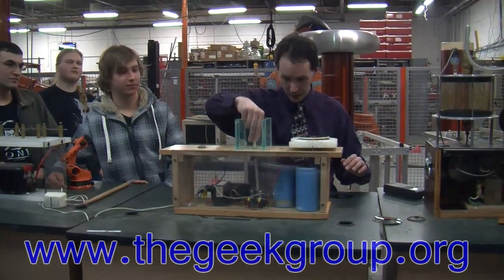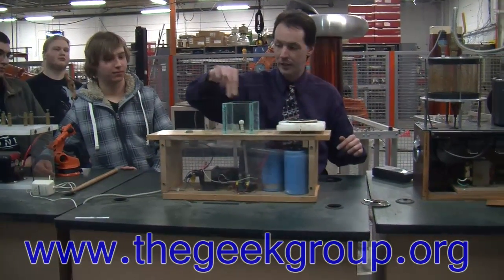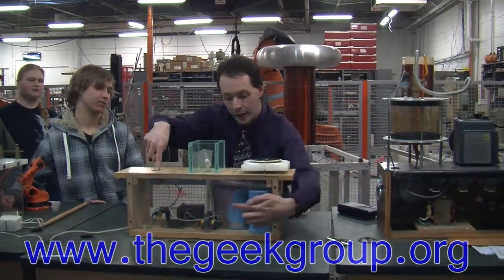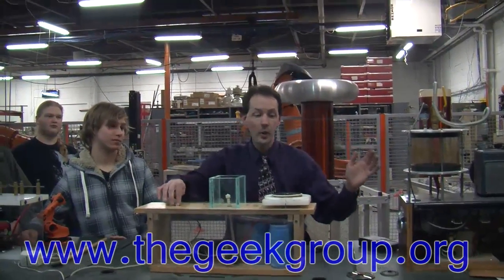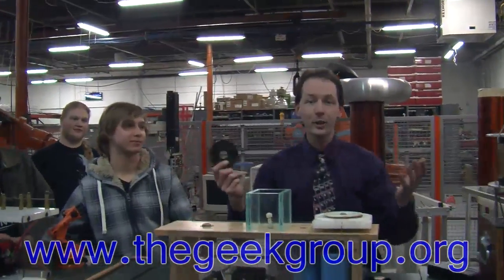We have a little thing here because there's a high current pulse when it does that, and sometimes it welds the contacts together, so you tap this to make sure they're free. Now look: you press the button down, the relay closes, the electricity goes into the capacitors. You give it a few seconds to charge and do its thing, and when you let go — there's your ring. Just like that. It's simple.